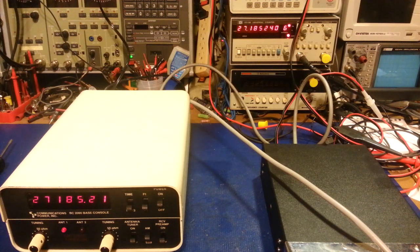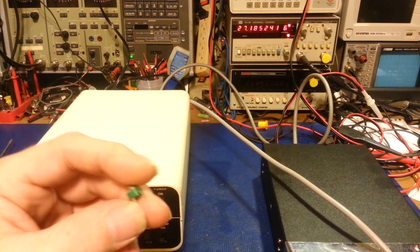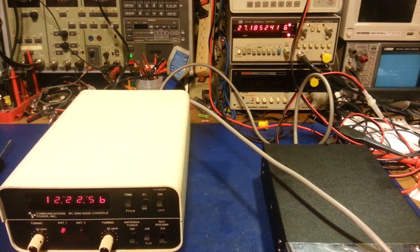Didn't have any real major problems other than assemble it, take it apart, assemble it, take it apart. It's the only problem with the design. Anytime you fix one problem, you put it back together, turn it on to find out that there's something else wrong. Take it, diagnose it, take it back apart to replace that component, because I recapped it, did the resistors, put it back together, turned it on just to find out that the frequency was completely wonky, and that was because of this little guy, and it has now been replaced, and you can see...